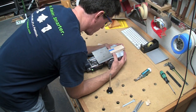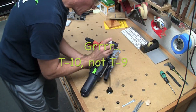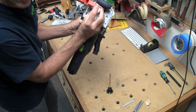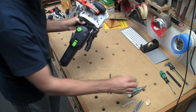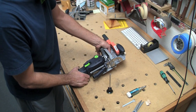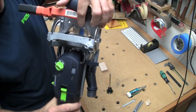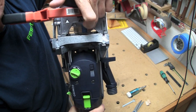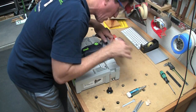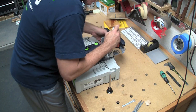Let me take a look at that. Now I'm going to take the T10 to loosen up these two screws so that the cursor itself can move. I had calibrated this once before so it was probably pretty close to dead on, but yours is likely going to be off — at least the two fences I've had have always been off. Scoot it over until the blue line from the tape goes exactly down the middle of that center line you see on the cursor. So let me go ahead and position that. This should be very close — it may not be perfect, but we can do some slight modifications afterwards.